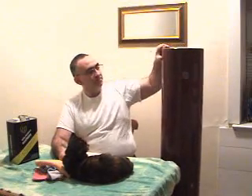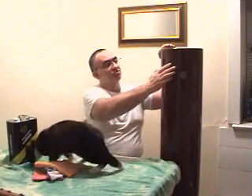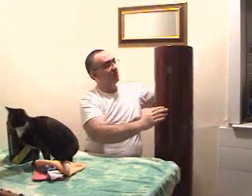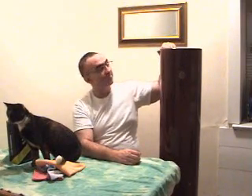Before I did that, I went through a test mounting. I drilled out the holes for the focuser with an inch and a half hole saw — I'm using an inch and a quarter focuser; I'm not a big fan of two-inch focusers on eight-inch mirrors. I also drilled out the holes to attach the focuser and the diagonal holder. Unfortunately, I did it wrong, so I had to drill out another set of holes. I also drilled out and fitted the mirror holder, which I bought many years ago from University Optics. I had everything fit, then I took it all apart and brought it to the powder coater.